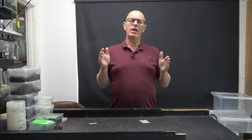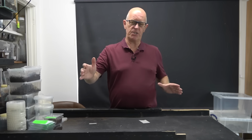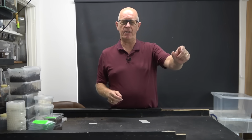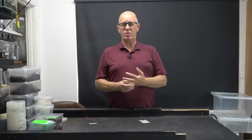So you can't rely on the board to give you a square, which is often a common mistake. People put the boards down, they put their edges in, and then when they get to the end, they're like, well, why is it half an inch thinner this end than it is at the other end? And that is purely down to the boards not being cut square at manufacture. So it's all them little different bits.